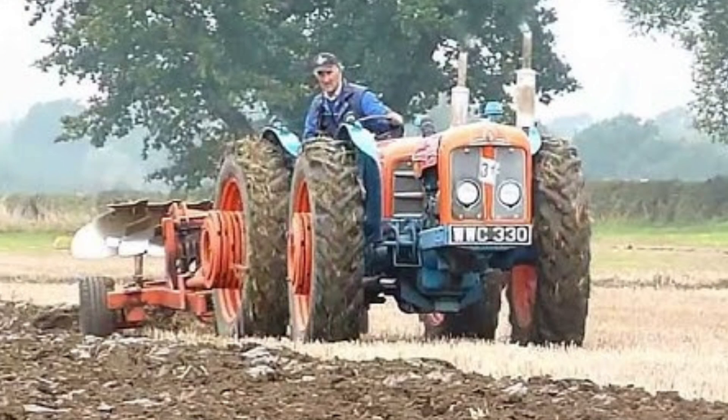The Triple D did have a couple of disadvantages. The main one was the lack of suitable implements at the time to match the traction and power of the tractor, which meant that Ernest Doe and Sons also had to develop their own range of implements to sell with the tractors. The use of two engines made controlling the tractor more difficult due to the need for two gearboxes to maintain and repair. Breakdowns increased and there was the challenge of mating the two engine RPMs and two gearbox ranges together so that both units shifted in sync — a lot of mechanics involved which did lead to difficulties.